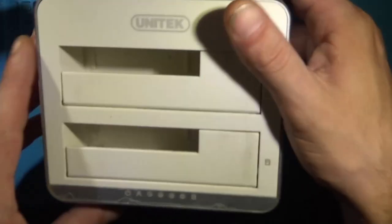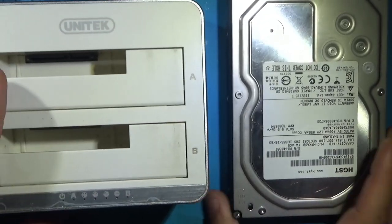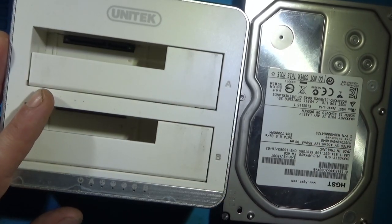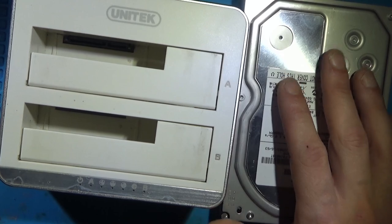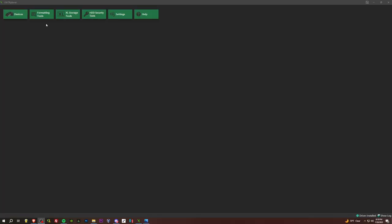Well, anyways, ladies and gentlemen, I've ranted long enough about the internals of the Xbox. We're going to hook this 4TB up to the computer, grab the latest Fatxplorer beta, format the drive and take it from there. I'm going to show you how to set this up from scratch. Then we'll flash Cerbios to the mod chip and get up and running. So let's do it.